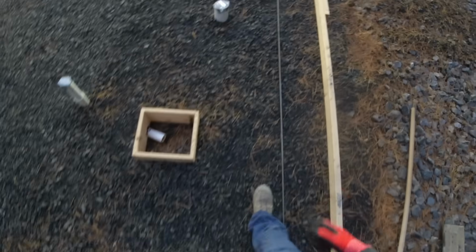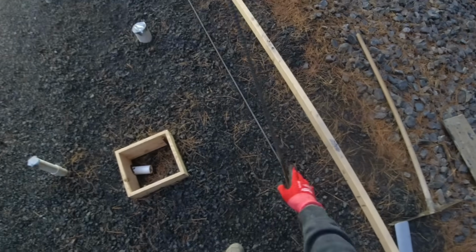So with just 2 people here doing this, I would rather have them tied up on chairs. That way we can focus on raking concrete, floating, straight edging, and not having to worry about picking these up. But as always, you kind of make do. So I like rebar around the perimeter. Then these at a 90. I like that. And we'll do probably 4 each way. Pretty solid ground. And it's not a real big slab. Okay, now we'll do 2 this way and 2 that way, and I think we're in good shape.